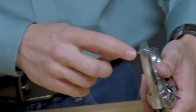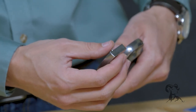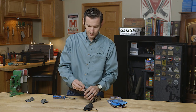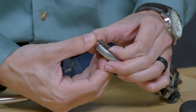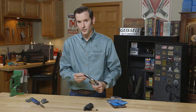Now if you'll notice, there's a cross pin — that's a roll pin that goes through the butt of the grip. This is going to be your indexing pin for your bracket. Take the bracket and flex it over that indexing pin; you'll have to expand it a little to get it on there. It snaps right on, and it'll be a little loose, but that's okay.